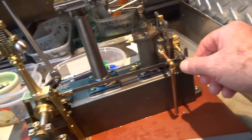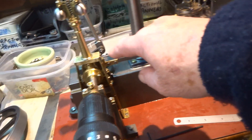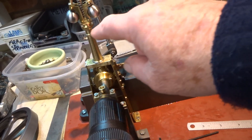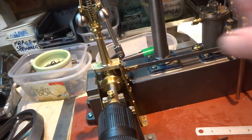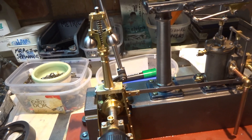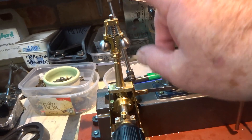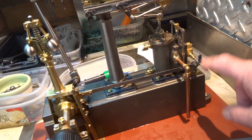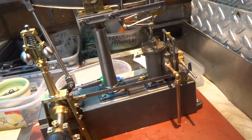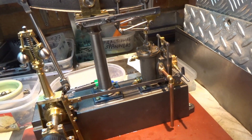So we'll need a rod and a fulcrum of some description into this - what do you call it really, a bearing or something. So this up and down movement translates through the governor to open and close the butterfly valve. Not completely sure how to do that at the moment, what that's going to look like, still.